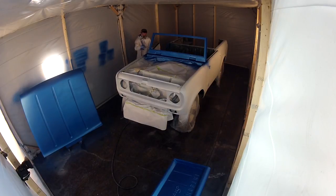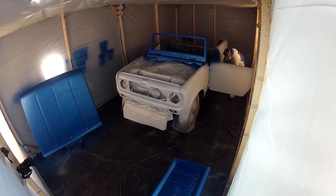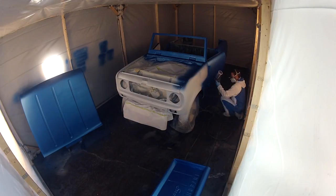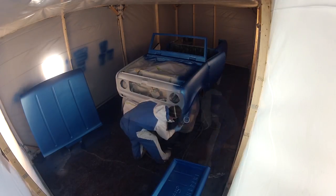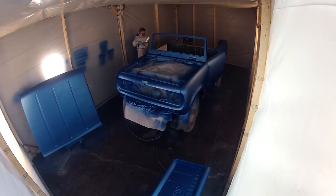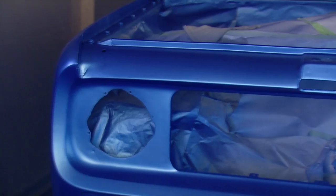We're going to let our primer dry for a couple of minutes. When applying your second coat, it might be a good idea to change your application pattern. This is going to help ensure even better coverage in the long run.